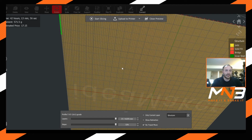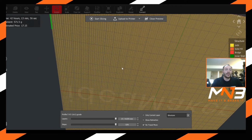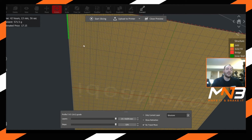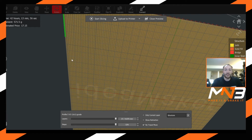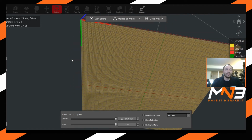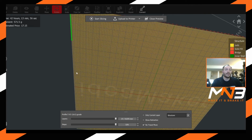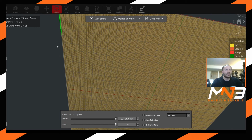Mostly it's there to recreate the build plate, but with a consistently level plastic build plate. You can see here, this is much smaller than the previous one. Normally my rafts extend 3-ish millimeters, 2 millimeters around the outside of the part, just to provide nice thermal barriers and sticking and all that sort of stuff. This one is 0.5 millimeter, so it barely extends past the edge of the part and the build volume. You can see there's not multiple layers over here on the left hand side outside the build volume. There's just the edge of this layer here that is outside the build volume.